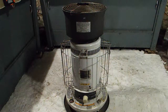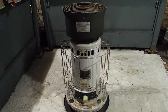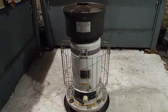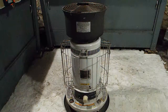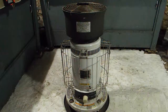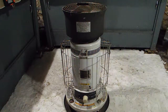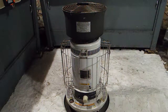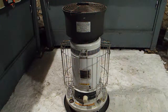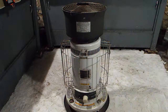You don't have to worry that much about carbon monoxide because kerosene doesn't put out near the CO that propane and natural gas does. I did a test once where I put a heater in an enclosed room with a CO meter, and it used up all the oxygen to the point it was throwing carbon strings into the air — and the CO was only 109, which is not enough to trip a CO meter. So you don't have to worry about CO; you have to worry about oxygen, which means you have to keep the window open.